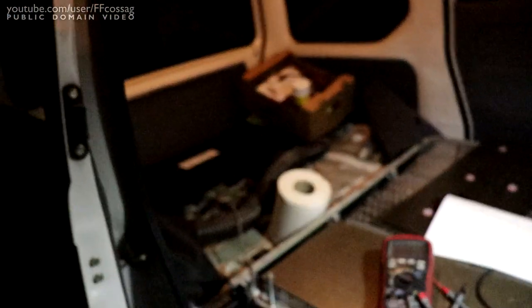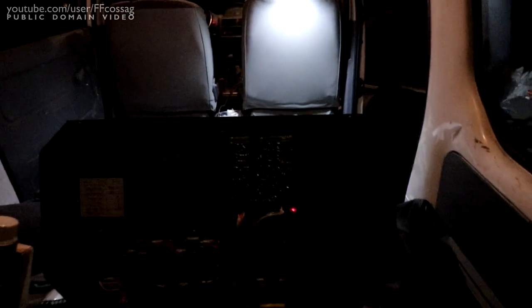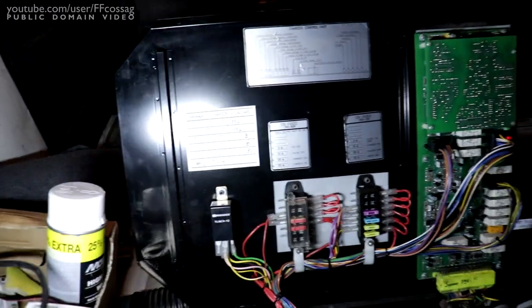So, now I'm just going to tune the charger a bit, because we need to charge this reasonably fully to be able to set the charge voltage. While the proper BMS is going to have reasonable charger management, this setup does not, never will. So I'm going to have to adjust the output voltage of the charger to reasonably match the fully charged voltage of these, which is a lot less than what it's set to for the lead acids, because while lead acids are 72 volts nominal, they require a lot more voltage to actually get charged.